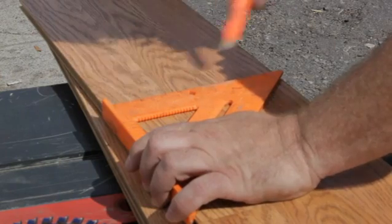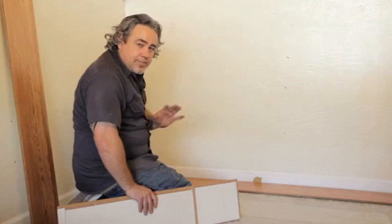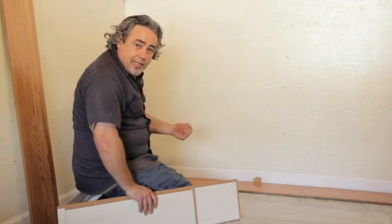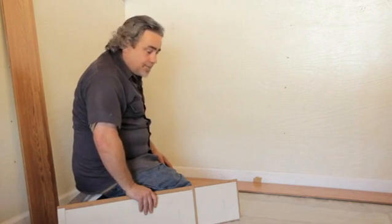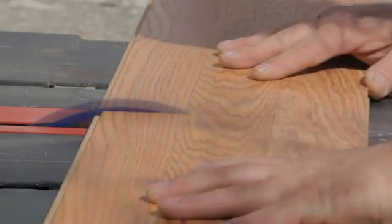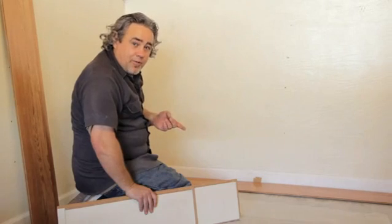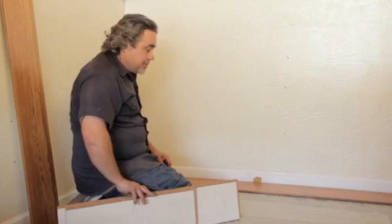When it comes to staggering the rows, each manufacturer is going to have their own specific measurement that they want you to keep when it comes to end joints and how close they should be aligned. So what I like to do, and I think this works for almost any manufacturer, but you want to check the instructions for yours, is cut 3 boards into thirds. A full length board, a 2/3 length board, and a 1/3 length board.